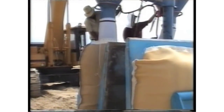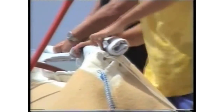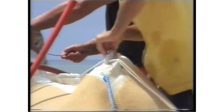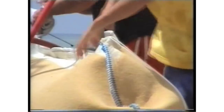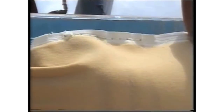The tying off procedure is probably the longest part of the filling process. The trunks are tied off with a cable tie, pushed back inside and tied off. The key thing to know when filling is that the fill height should be within 200mm of the top of the container - when placed, these 2.5m³ containers should stand at least 600mm high, and then you know you've filled the structure properly.